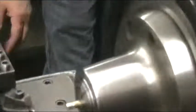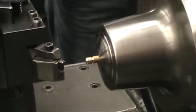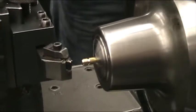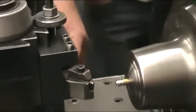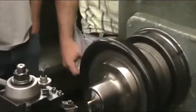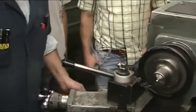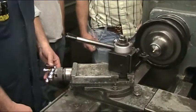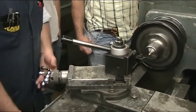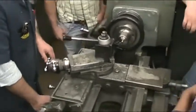So when you disengage and you pull out. I do, yeah. And it's just because I've done these really weird. And see, now it's still going 50 thousandths per revolution. But we're doing a lot more revolutions. And it's still not fast enough for what the actual RPM should be for threading. Okay, I'm just going to back up here to the 2, engage it. See, if you back up, you can engage, and then you just wait for it to go, but you can get ready. And always keep a hand on this half nut engagement lever and this one.